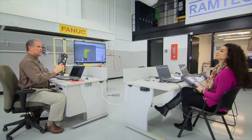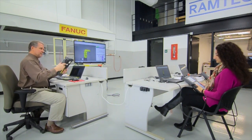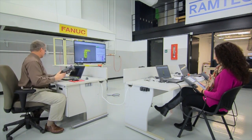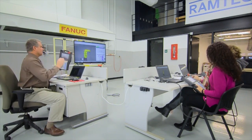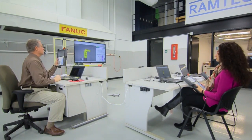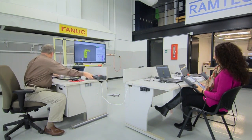We just need to know that on either one of them, the first click position is a position that allows you to manipulate the robot. And if you go to the top of page 44, you'll notice the on-off switch. For what we're going to be doing in these exercises, we will just be keeping the on-off switch in the on position. It's in the upper left-hand side of the teach pendant.